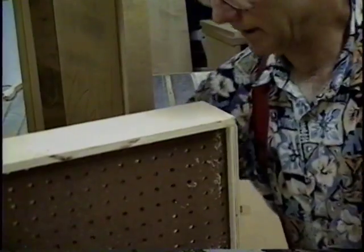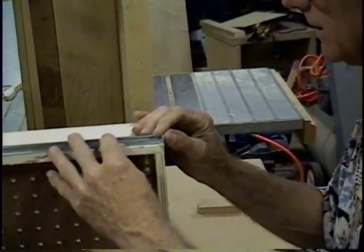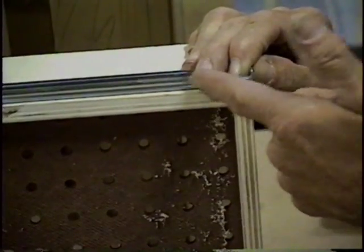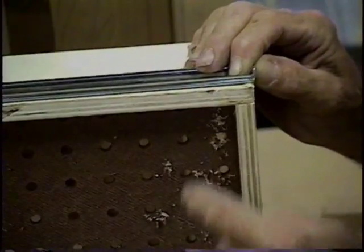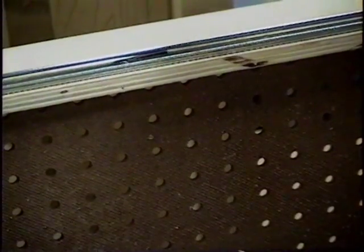There are hundreds of different drawer guides, and there really is. So you really can't just use one drawer guide for every instance. Since these are full extension drawer guides, what I normally do is get myself at least a quarter of an inch — an eighth of an inch from the bottom of the drawer to the edge of the drawer guide itself. Usually an eighth of an inch is really good because that way you're not hitting into that dado right there. You're far enough away from it. Put some screws in there — same thing on the back side.